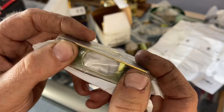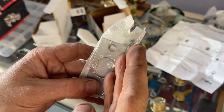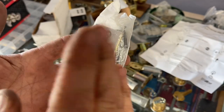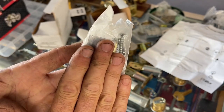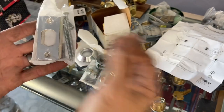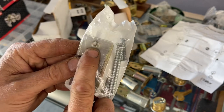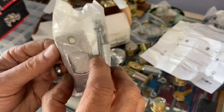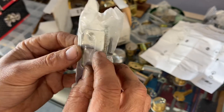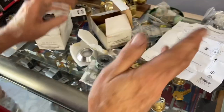These shorter screws are a little bit longer than normal. For a wood frame you'd want to use the security strike. One of the wonderful things about these deadbolts is they're pretty thin. On metal frame doors, if you drill the one-inch hole you sometimes don't have enough gap — sometimes you can't even use a thimble strike. But if the door does have enough gap, these trim plates provide a nice finished appearance and they're thin enough to actually use, which is rare but does happen every so often.